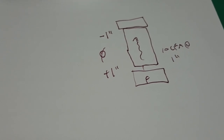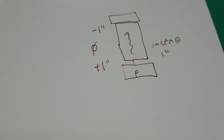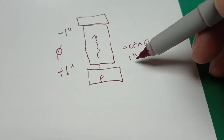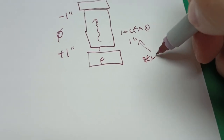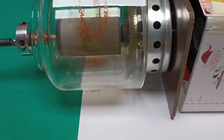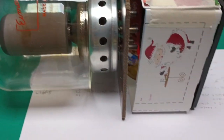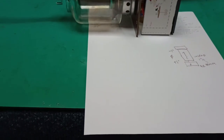Now that's very simple. That's mechanical. That's not electrical. But what that implies is that there's no pressure in between. And now we're violating the desired condition of 10 CFM at an inch, and realize that this factor here is what more or less creates air density. And the air density means that there's more air molecules flowing in the space between the inside of that chimney and the outside of that glass to carry away heat. As that density approaches 0, it approaches a vacuum, and there can't be any heat transfer, so the tube will burn up. So he said he'd put a fan below each, and then one to, in my terms, probably evacuate the cabinet.